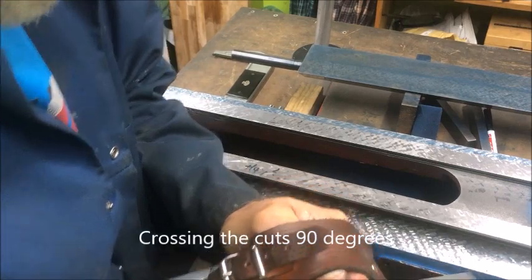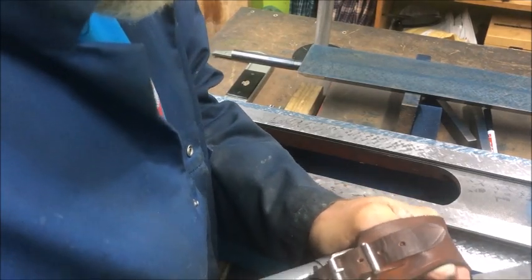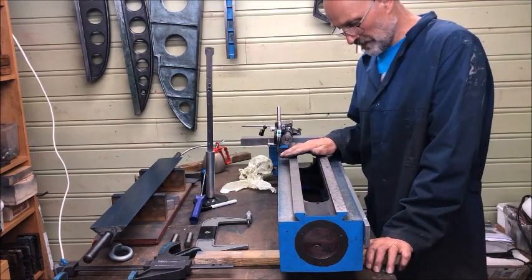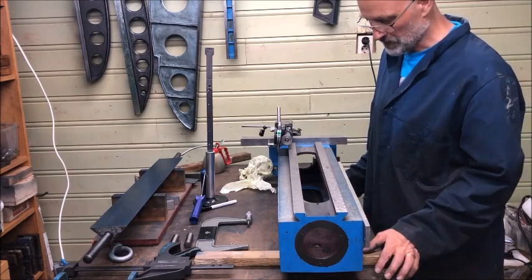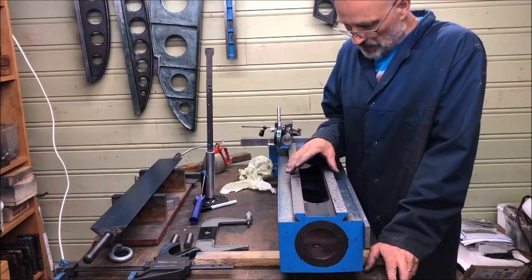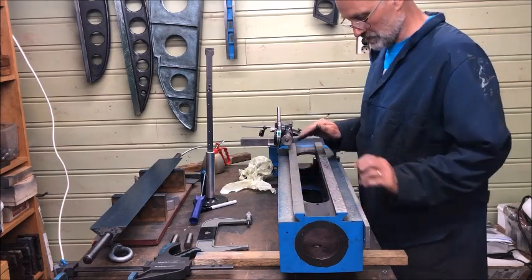So the individual rolls and the individual marks. I have now, by means of scraping, established a little bit more finer surface finish than just the fine mill finish that was there. And there's always a chance that you scrape it a little bit differently, so you have to realign it. You have to measure constantly between the scraping cycles.